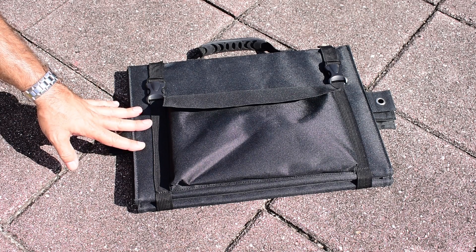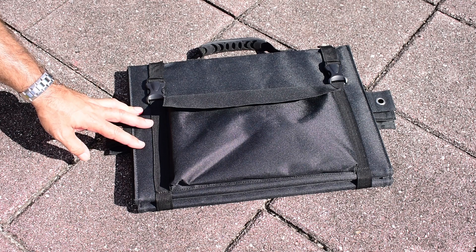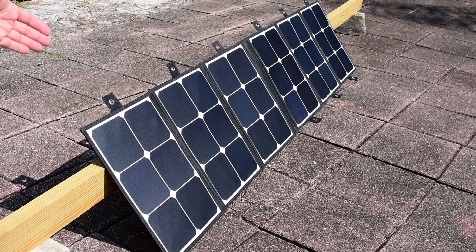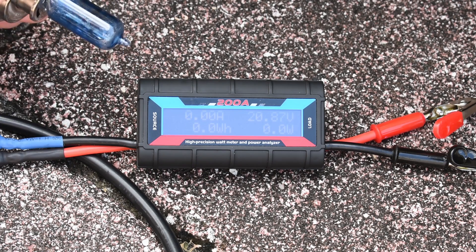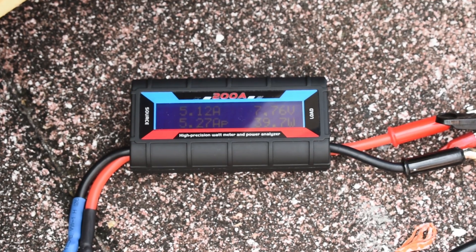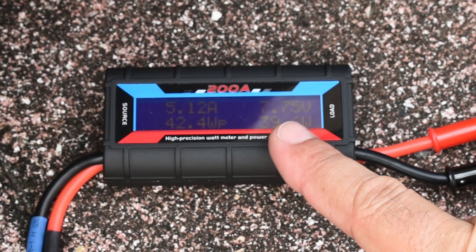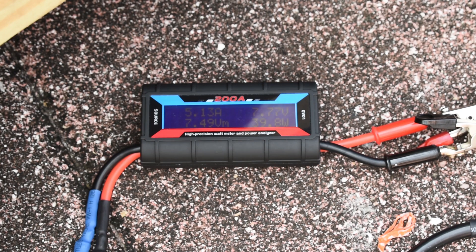Next I want to show a folding solar panel whose wattage output is grossly overstated — it claims 170 to 180 watts of output. The panel has six sections and appears well made, but testing it shows an open circuit voltage of only about 20.9 volts. Connected to the halogen lamp, it reads 7.75 volts, 39.7 watts, and 5.13 amps — nowhere near 170 to 180 watts. Under the right conditions this panel could likely put out a maximum of only around 45 to 50 watts. It's a shame that so many companies online lie about panel specifications.